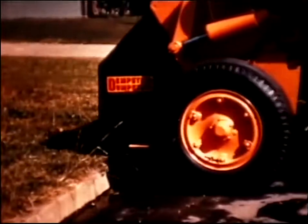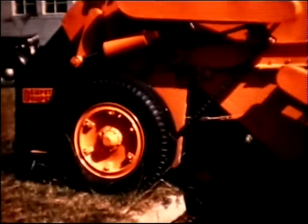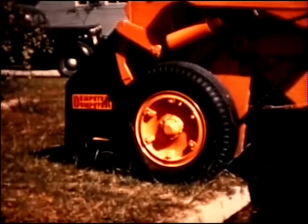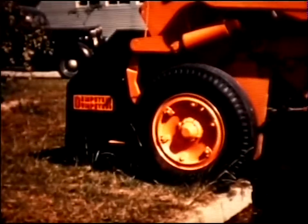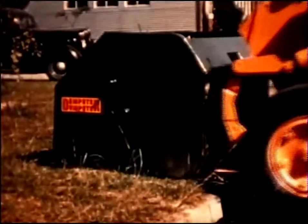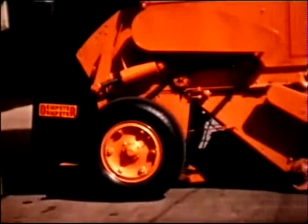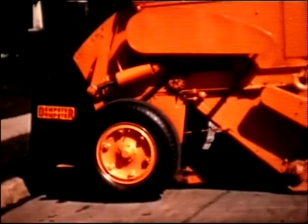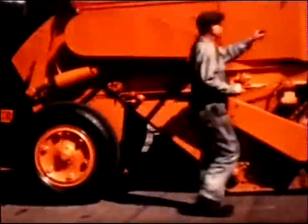The Elgin 81D climbs the average curb under its own power for either depositing a loaded hopper or picking up an empty one. On occasions where curbs of extreme height may be encountered, curbs above 7 inches and too high to clear spray nozzles, the operator may use light ramps for the placement of loaded hoppers or the pickup of empty ones.